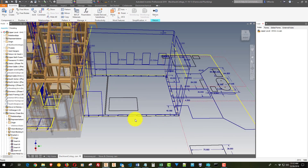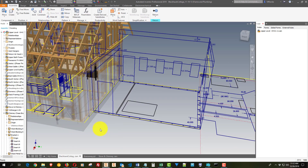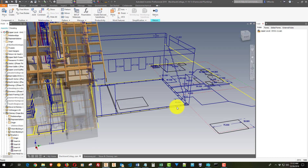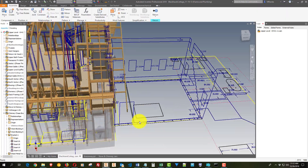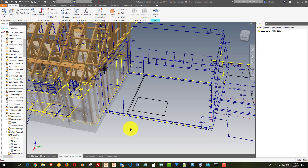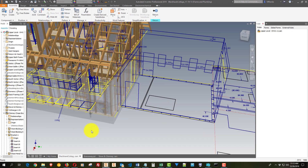For now, this is on a slab. The house is on a slab as well — it's a frost-protected shallow foundation, an FPSF. It's heave proof. I'll go into that in detail when we start the work, but it's been in use in Nordic countries for many, many years. It works just fine — no heaving. It traps the earth's heat so it never freezes underneath, with wings of insulation underneath the ground.